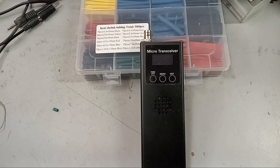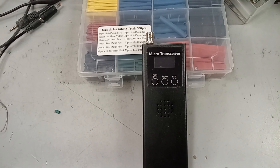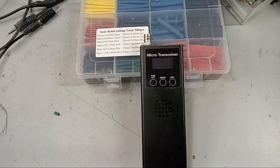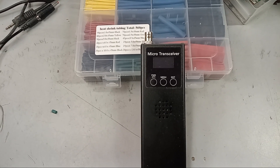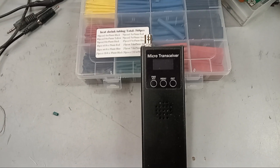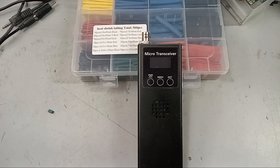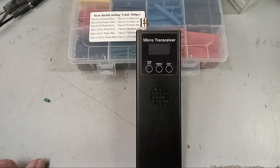The radio is defective — it doesn't transmit now. The software glitch I found: if you put it in CW mode, then go to the menu selection for the keyer and turn on the iambic keyer with no PTT button pressed and no keyer hooked up to it, it just starts transmitting on its own. I kept triggering that before I could get it turned off, smoke came out, and then it quit transmitting.